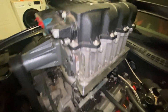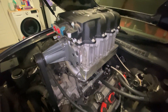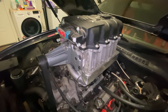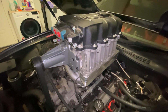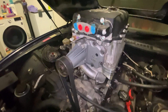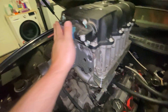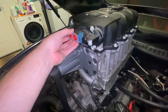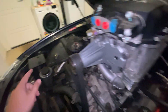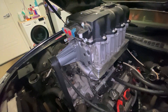I'm thinking I'm going to probably upgrade to like a 92 mil LS throttle body, just because it's a pretty popular, easy to get throttle body. And I've already got it set up for similar sensors on the L67 throttle body that I currently use. Once we've got that done, we need to make that intake and make a little flange here. So we're going to have our lines go to the water-to-air intercooler, and they'll manage to go back down to that tank there.